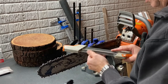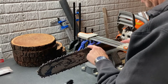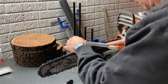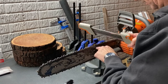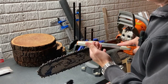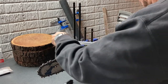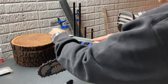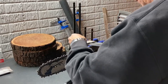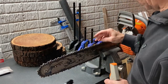It's really pretty easy to use. The nice thing about this is that it will also file the rakers as you file the link. So as I move like this, it will also file the raker. Basically you give it as much as you need — I would say between five and ten files. Just keep it level and push right through. So that's three, four, five. And again, you want it cat-claw sharp.